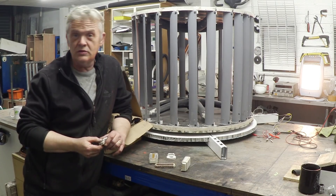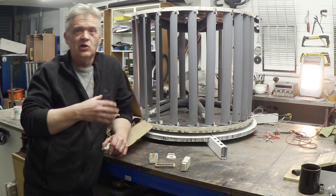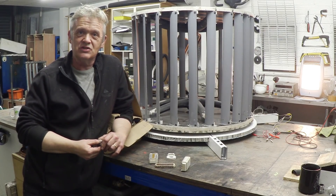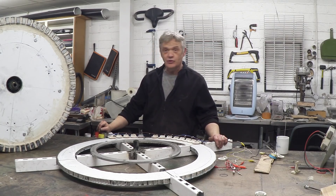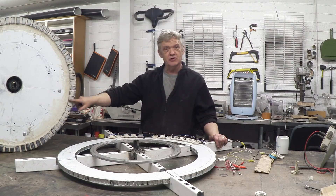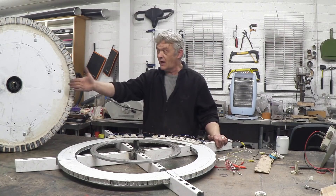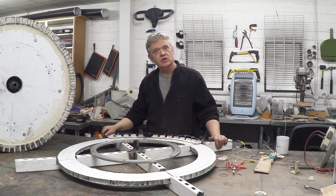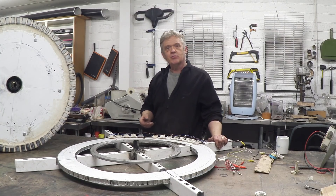I've used these coils on this, and I've put about a quarter of the coils on. The plan is to pull it apart, have a look at it, talk about it a little bit, put it back together and then give a quick demonstration. The rotor hasn't changed at all — I've laid it on its side so you can see the magnet arrangement. It's basically a big wheel with many magnets on the rim going north, south, north, south on their faces.